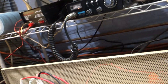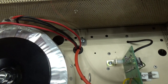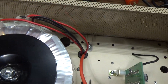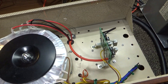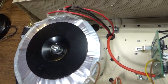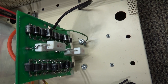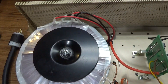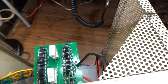Over here on top you have the high voltage toroid transformer. It has two 950-volt output windings so you can use it as a voltage doubler or put them in series for a full-wave bridge. The original amp used a smaller transformer with a voltage doubler — a really weak, undersized circuit — but this one has the big toroid running a full-wave bridge. Those white resistors are glitch resistors: if there's a big short, they should take the hit instead of shorting out the toroid transformer.